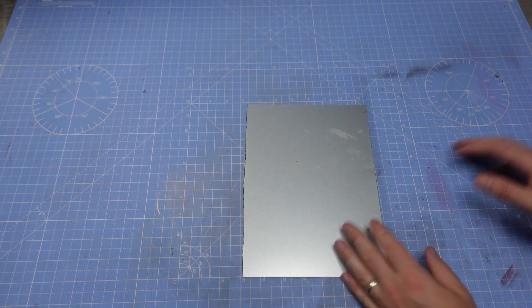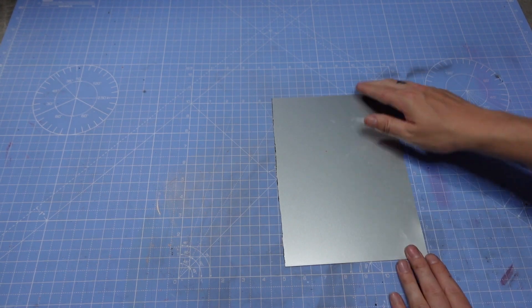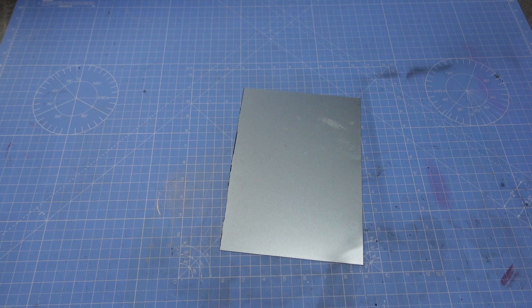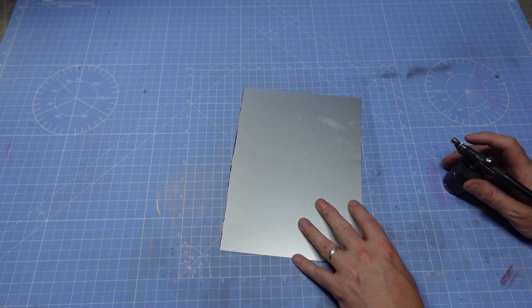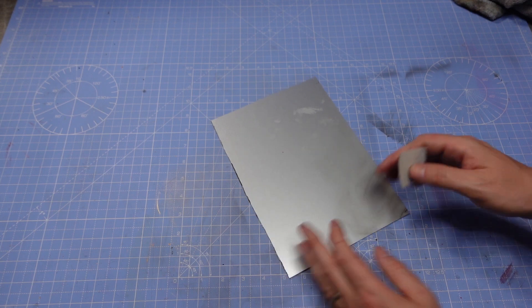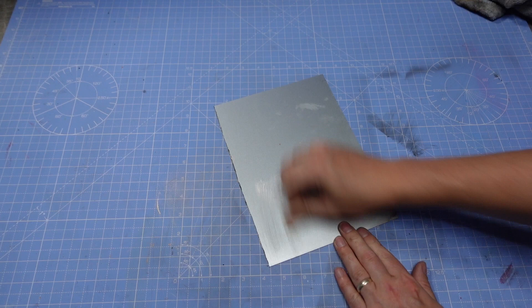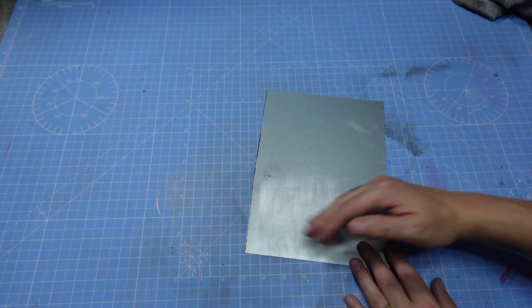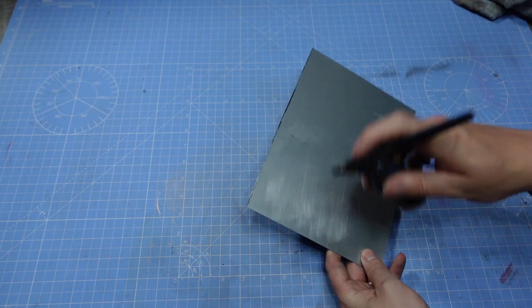Okay, so let's get into it. We've got our photo frame, we've got our piece of metal all measured up and ready to go, just need to paint this now. Again, it's up to you how you want to paint it. Like I do in all my videos, I'm going to be using an airbrush. I'm just going to be using this as a test piece to see what power and speeds I'm going to need. Before you actually paint it to get a nice even coat, just get yourself a bit of sandpaper and we're just going to rough up the surface a bit. You don't want it smooth, you don't want it tidy — just rough that area up a bit so then when we apply our paint it adheres well.